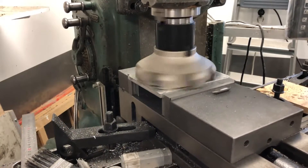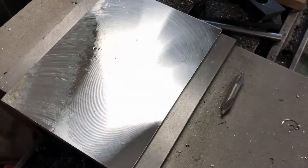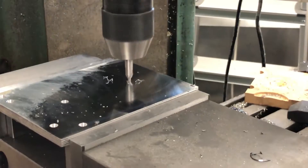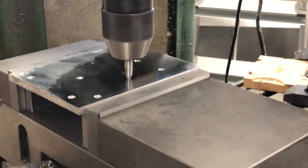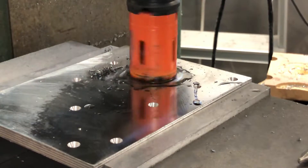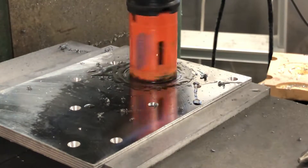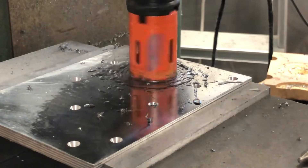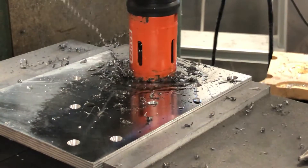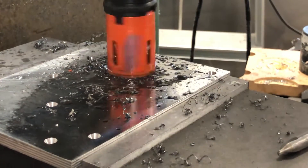These plates don't need to be 100% flat so I left a little low spot rather than taking off even more material. After squaring and facing the plate, it's time to spot drill to get an accurate position and minimize wandering when it's time for the real drill. This plate has two bigger holes where I decided to try hole sawing. It's quite difficult on this machine because there's no quill and the knee is very heavy, making it incredibly insensitive. On power feed it doesn't break the chips well enough, and on manual feed it's near impossible to be sensitive enough — and before I could catch it, it stuck the hole saw real good. Eventually I kind of got the hang of it, but it was definitely a stressful maneuver.